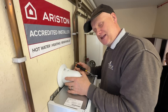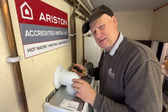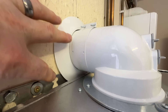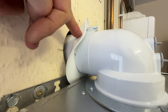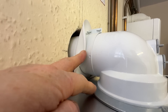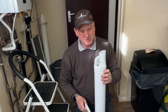We're going to leave the flue securing screw as a deliberate fault for our trainees to find — though they all watch these videos, so maybe I'll put one screw in anyway. A little complaint: this cover doesn't fit very well because of the bracket sticking out here, and it's an absolute nightmare to try and put sand and cement on that flue. Don't forget, guys, you will need sand and cement on the inside and the outside even if you do put the securing screws in.